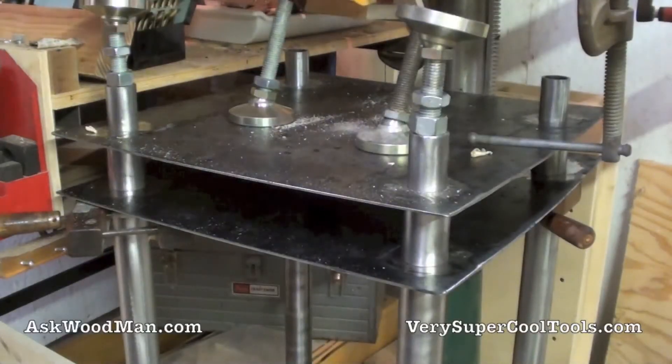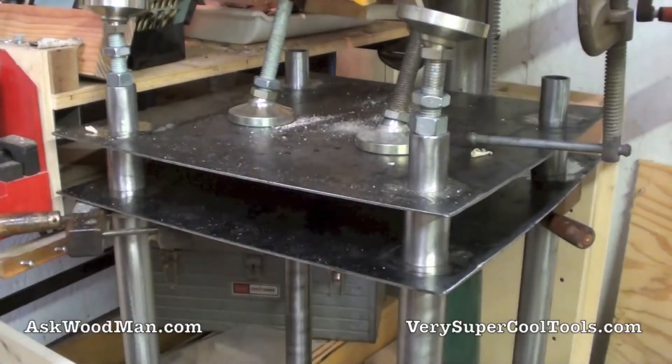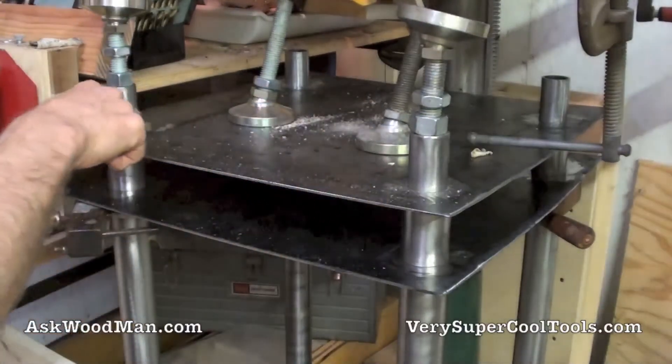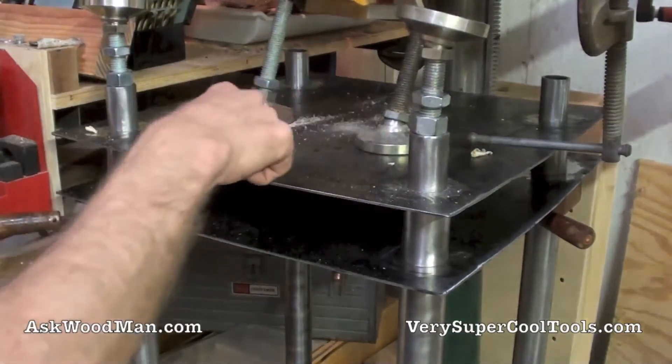This is the next day from my first fabrication day. I've thought about a couple of things and I really can't stand this curved material. I regret cutting this with my oxyacetylene torch because I put too much heat into it and it got wonky. I've got some 3/16ths by 1-inch flat strapping, and I'm going to cut some pieces to go in between here, pin it flat, and then stitch weld it — not a full bead, just weld it to the pipe.